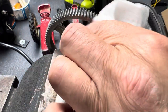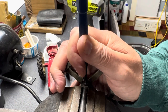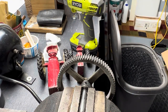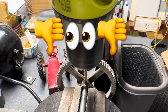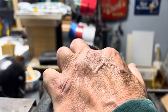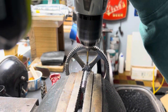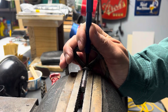As you can tell, it works great. I just really took my time, because I know this wheel is made of a cast metal. I have had wheels like this break on me before, off an old apple peeler — well, I dropped it, but it still broke. Just a series of lubing, drilling, filing, whatever — just ever so careful, I was able to eventually get to where I can punch this hole out, or punch the pin out.